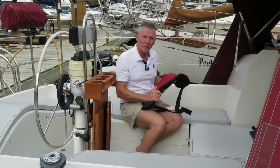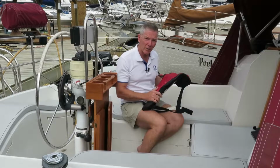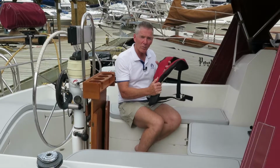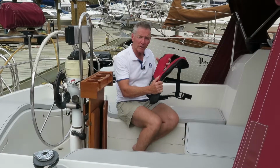My name's Marco, I'm a Sail Canada cruising instructor, and in today's video, we'll be talking about the Mustang Inflatable PFD, how to select one, and how to rearm the hydrostatic version after deployment.